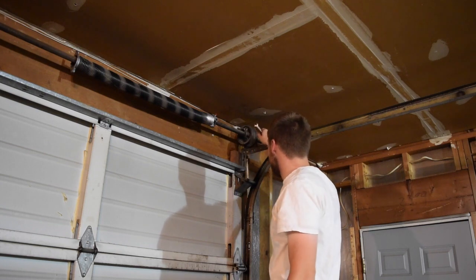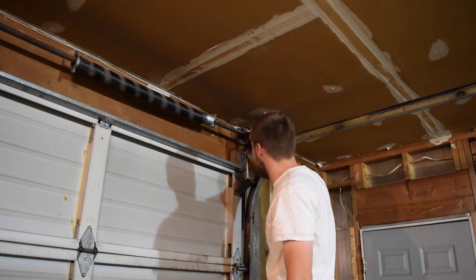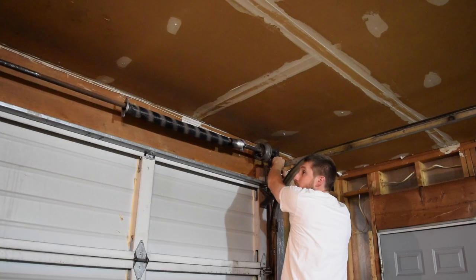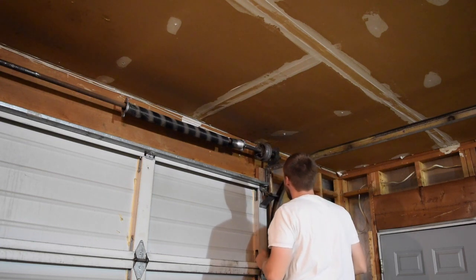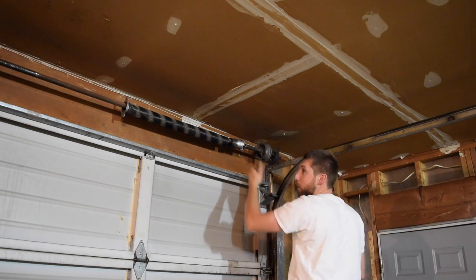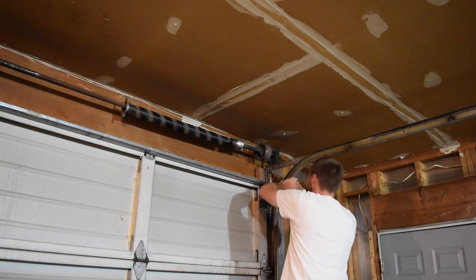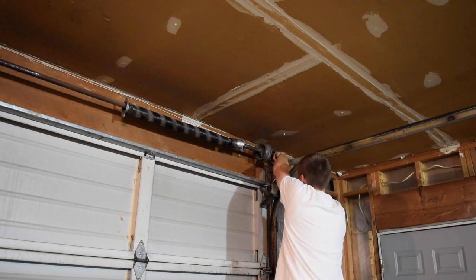So there's 2 bolts on this I'm going to loosen. Before I loosen that and take it all the way off, I need to mark where it is so that I can match it when I put it back up. So I thought I could just slide this out, but this isn't sliding on the bar this way, probably just because of the junk on it, corrosion or whatever. But I am replacing these brackets and bearings anyway. So 2 bolts takes that off.